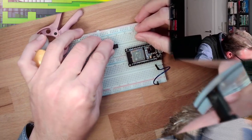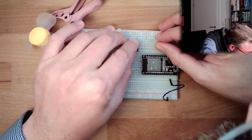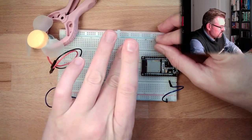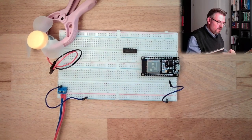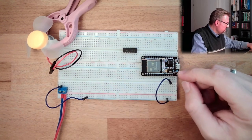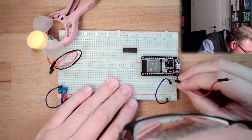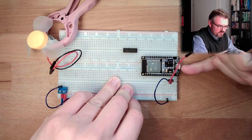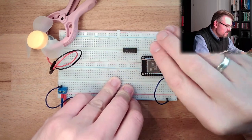So, let's place the driver simply somewhere. Here. Looks good. Alright. So what do we need? We need the motor control, the logic, the motor logic. Here. And I will use the V-in pin from the ESP, because this is actually USB power, where you plug in USB, so V-in has 5 volts. USB is 5 volts. So I'm using this.